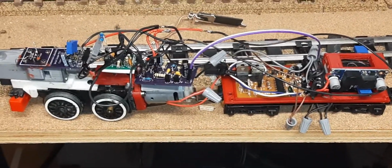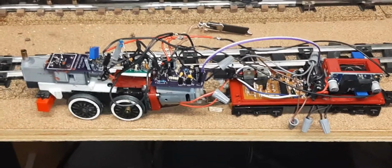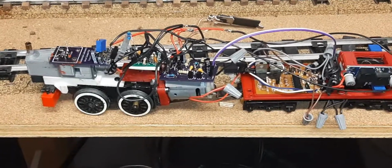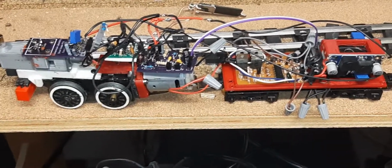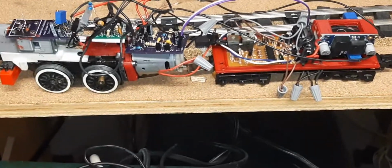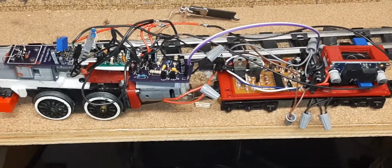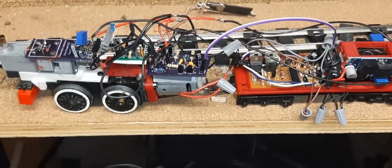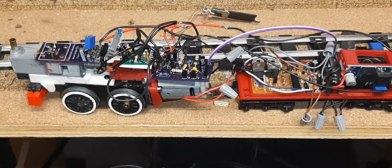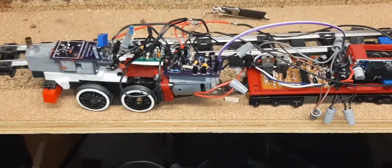I did some testing and measurements on the test stand and found that I was a little low on my heater, and I might need a second or another boost board like this one to accommodate the various devices. I didn't go over 1 amp, so I'm not overloading from a watts and amps point of view, but I feel like I just need a little more headroom to maintain a reasonable smoke.